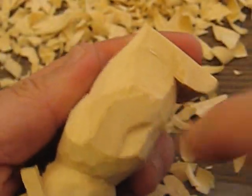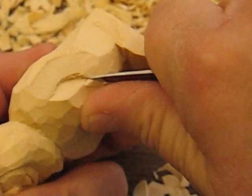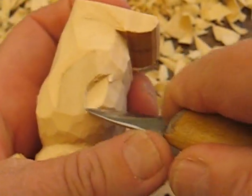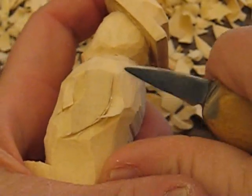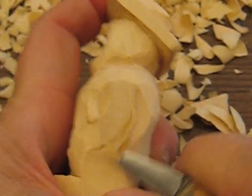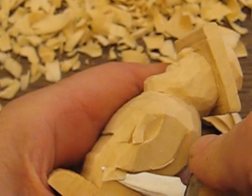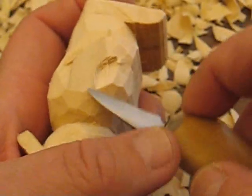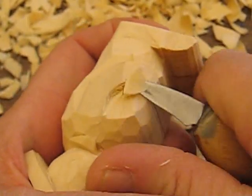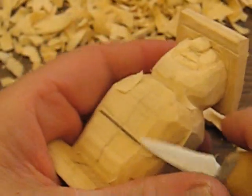So I'm going to go back to this arm and take it out and around, just like so. We're going to dig that out further and do the back side of it. I prefer doing my cuts away from myself — it's such a natural reaction for me. It's a great way to control the knife away from you, as long as you're not slicing a lot of wood at one time. I'm going to hollow this out a little bit here and bring this around to the center.